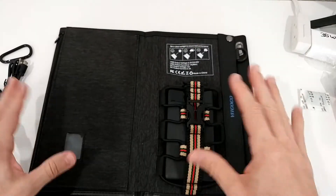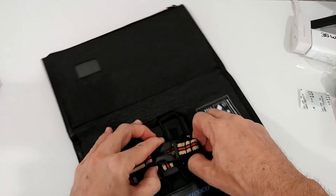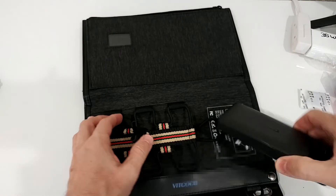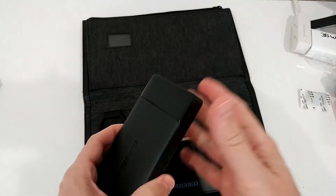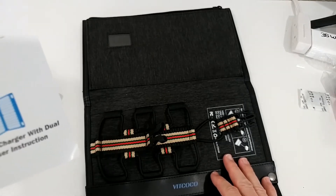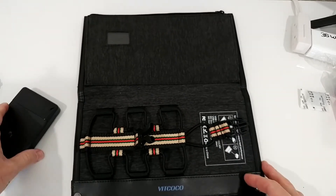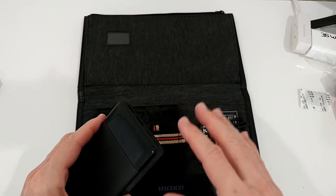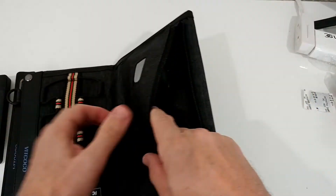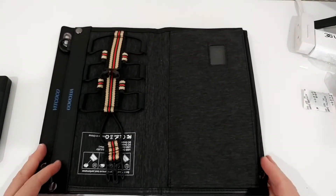We're talking about a 29W solar panel, but with USB we can only get 17 watts. The 12-volt output is what provides the full 29 watts — at 12V times 2.3A that's 27.6 watts, close to the rated 29W. You need the 12-volt output to get all the power out of this. For now, 17 watts through USB should be enough, giving around 3 amps — which would be really nice to achieve.